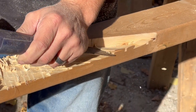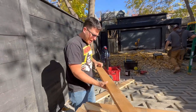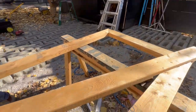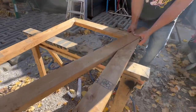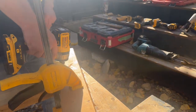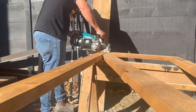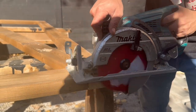We know we marked the bottom with the B — this is why we mark it. The moment of truth: let's see if this lap joint fits. And there you have it — a nice little lap. Since we have a nice little lap where both pieces are an inch and a half total, we have inch and a quarter screws, put them straight in, and laminate those two pieces together. Easy peasy, lemon squeezy. We flip it over and here's the fun part — take our circular saw and cut along the edge of the gate on both sides, get them all trimmed up real nice.